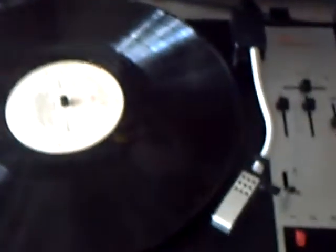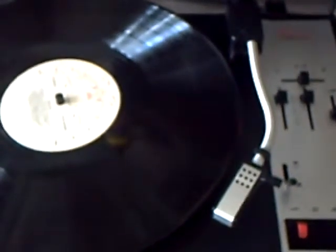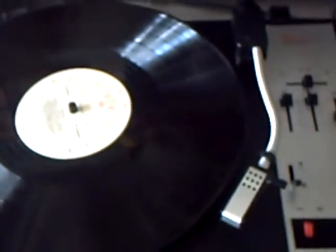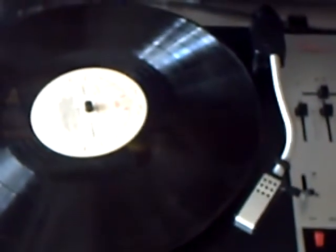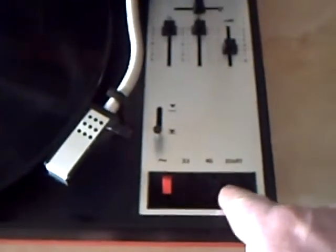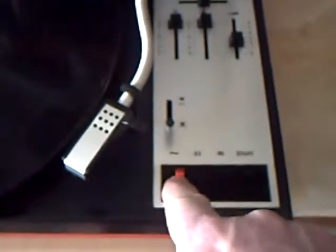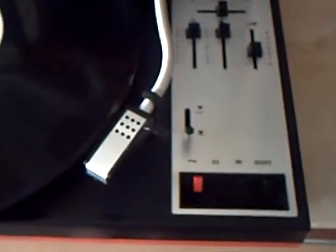Now, this record player should switch itself off when it gets to the middle, like many old Philips ones did. Just shut the motor off. It doesn't return the arm to the armrest, and never has. And to switch it off, there was an ingenious optoelectric system inside, but that has stopped working. The good news, however, is that instead of pressing start, which does nothing at all now, select the speed 33 or 45 and then simply press the power on, and as you can see, away we go.